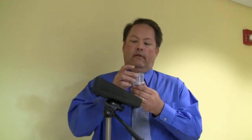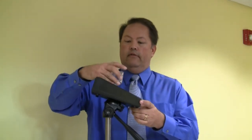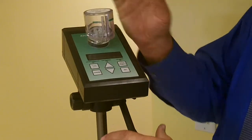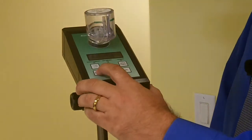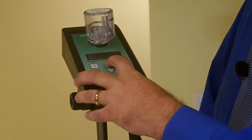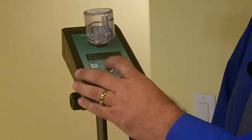With that in position, we can then calibrate the air pump. This is necessary any time we start the air pump — we must recalibrate it every time. For that purpose, we have a primary calibrator that we use in the field, and it attaches to the air pump in such a way that the calibrator is vertical. We turn the air pump on and set it to the calibration mode, then start the pump.